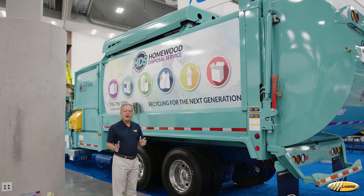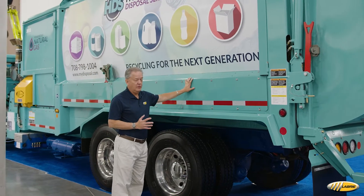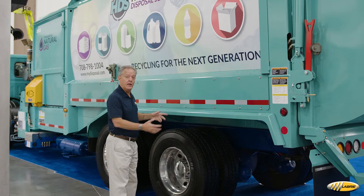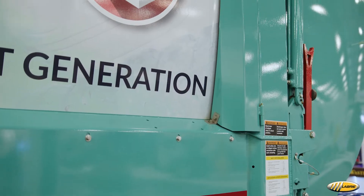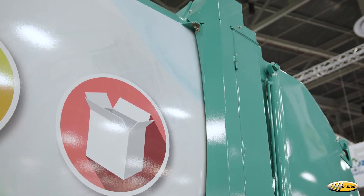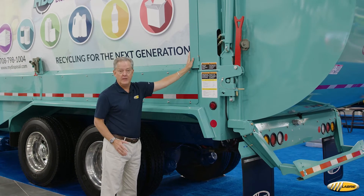A couple of things to talk about on the side of the truck. These panels are bolt-on, bolt-off, and underneath we have our hydraulic lines and our electrical lines. For the mechanic, he can work on it at chest height. Similarly, we have a hinged cover for any lines going up — in this case, it's CNG. We have a bolt lock on it, but it's protected from any damage.